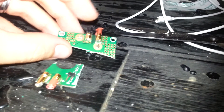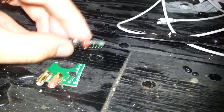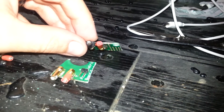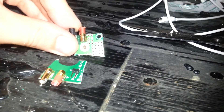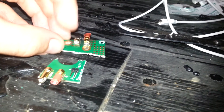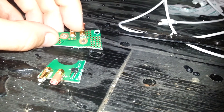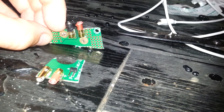Here's the problem. You got these two nice big connectors, some decent sized — I don't know, maybe 10 gauge, probably 12 gauge, maybe 14 gauge wire coming out of there, and they're all soldered on nice — nice soldering. Problem is all there is is a tiny little film of copper sending all your power through this.